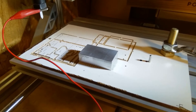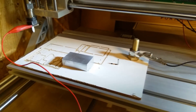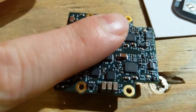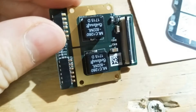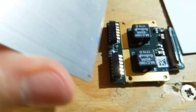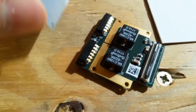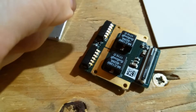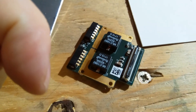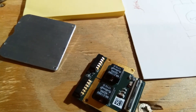That's a project for another day, but for today we're going to take a look at this. So over to the computer — but before we go, this is the circuit board in question. There's my finger for comparison — it's fairly small. I need something to mount it on so I can hold it. It's essentially got to hold this LED board in position against it, and the gold area is where this piece of metal has to go. So I'm going to be marking out four holes and that sort of U shape, and then machining out that material.